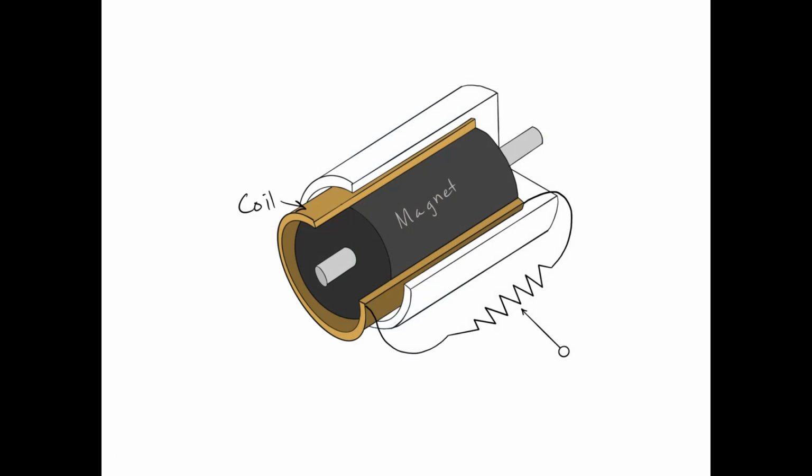The last type of semi-active suspension is the electromagnetic damper. This is where the dampers are a type of linear DC motor, and the coils are linked to an external resistance circuit that can vary the dampening based on the resistance. I'm not aware of anyone yet using this in a production car, but in theory it would be a very fast reacting solution. This is totally possible for an RC car, but everything would have to be built from scratch.